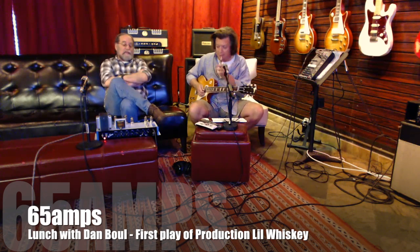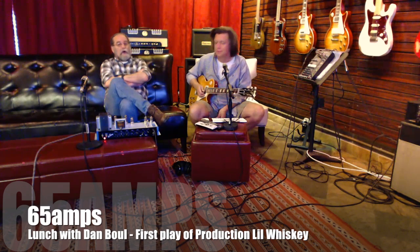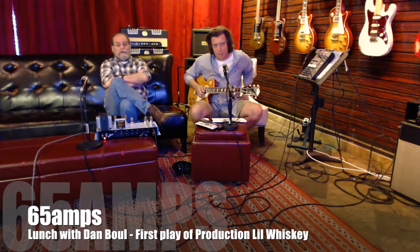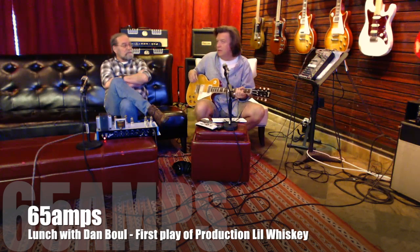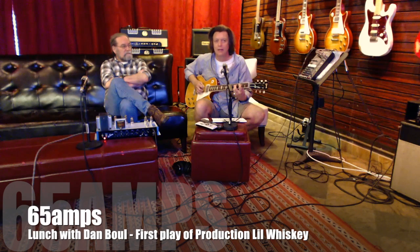No, see, one of the aspects that when I first saw this amp, one of the things that I really liked is your choice of resistors, because I've never been a fan. Yeah, you don't like the carbon comps. I mean, they have a certain sound, they do something, but their values change as they heat up and cool down. They crackle, they get noisy. So I've always been a big fan of metal film, metal oxide, carbon film. I only use them under low stress. I don't put them in any high stress positions. And then, my amps aren't real, there's not a lot of gain. But now with something like this, it probably would be too noisy.